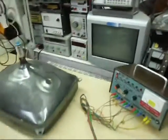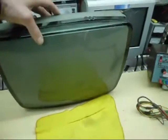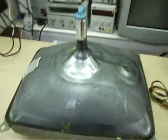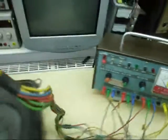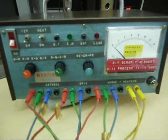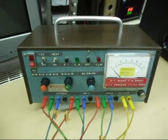I'm going to show you a little tool I made over 30 years ago when we had CRT screens - cathode ray tubes. You had exactly the same problem: if a TV was dead and wouldn't come on, you didn't know how good the tube was until you got it running. So I developed this CRT emission tester - completely handmade. It plugs into the neck of the tube, you switch it on, and the meter on the front reads out shorts on the cathode, shorts on the grids, and the emission level, so you can check the tube before you repair the TV.